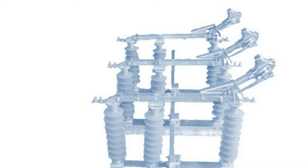If you have been a student in my Substation Fundamentals course, you probably would remember that I did mention that switches are not designed to operate while energized. But there are switches out there that have load breaking capabilities. This is through additional functions implemented in the switch designs to quench the arc that is formed when operating a switch energized.